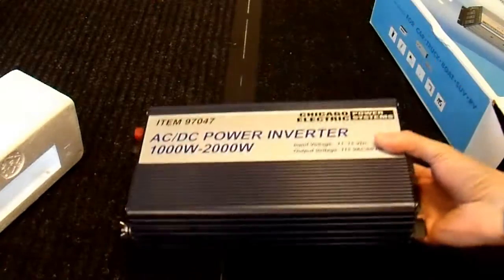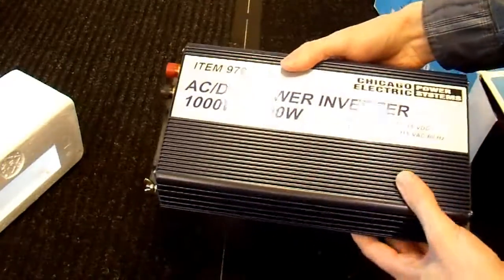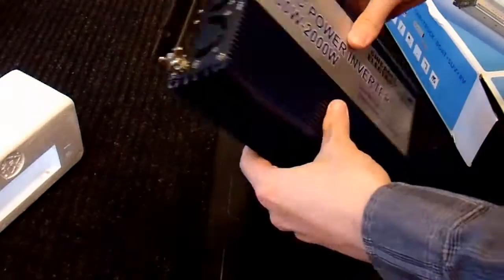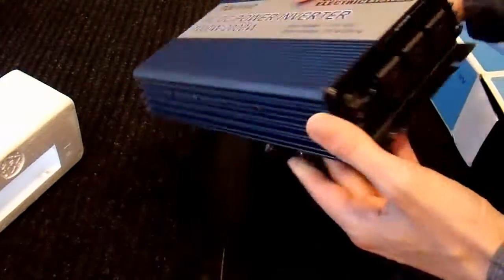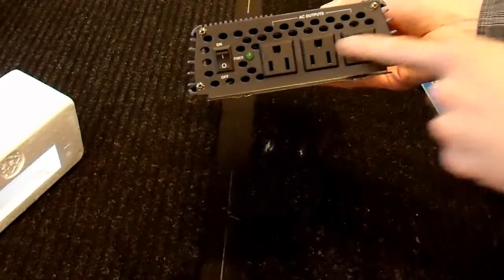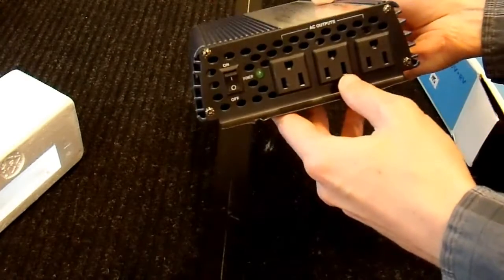And there's the inverter. So I actually did buy this one broken, and I repaired this inverter, and I had a pretty common problem that a lot of these inverters have. It looked like somebody had plugged the output into an AC outlet that was active, and it blew up the output stage. So it was a fairly easy fix if you have the parts for it. But otherwise it's a pretty standard construction inverter.